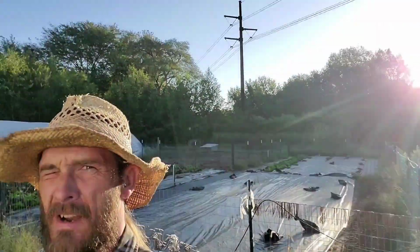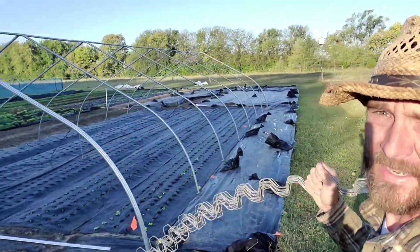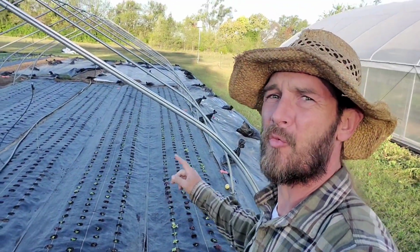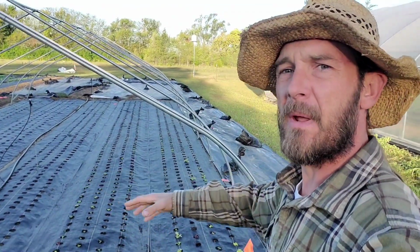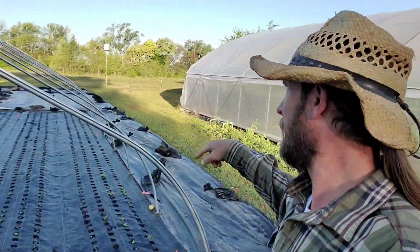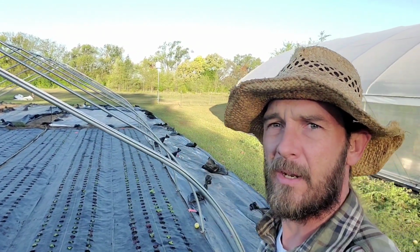Okay, got a nice clear morning. Sun is just starting to peek over the trees over there. Got my wiggle wire. I'm going to get the skin on this thing real quick. I'm going to leave it long and dirty for now. It's supposed to frost tonight. Frost won't kill this, but it'll sure slow it down, so I really want to get this covered no matter what. So I'm just going to leave the extra at both ends, and let's put some sandbags on it or something. Wiggle wire track, both ends. I'll get the rope, start to run it back and forth for the caterpillar shape. But let me show you here.